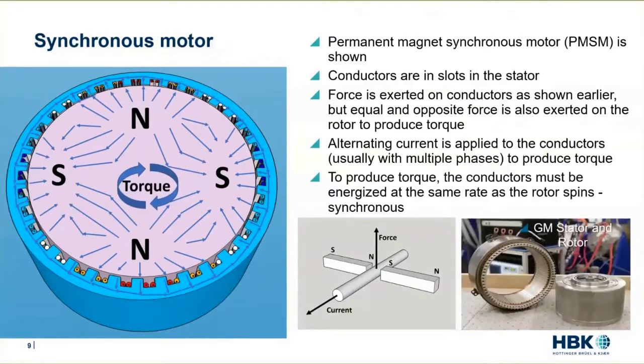All we need to do is add conductors and then we have our electric motor. The conductors are usually buried in slots in the stator. In this case I'm showing a three-phase motor, so I have a set of wires wired to one phase, then a set wired to the next phase — maybe a peak current going upwards, then a 120-degree phase going upward, then zero phase, then 120-degree phase downward, and then full current going downward. Now we have a fully functioning electric motor that's producing torque.